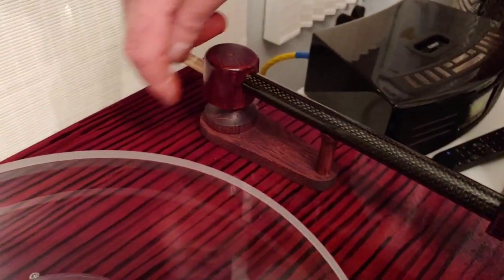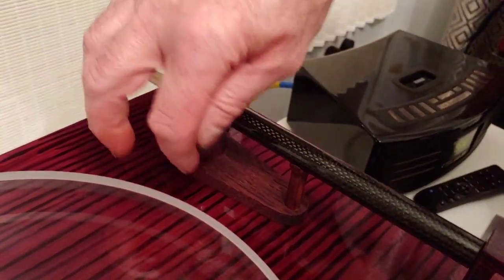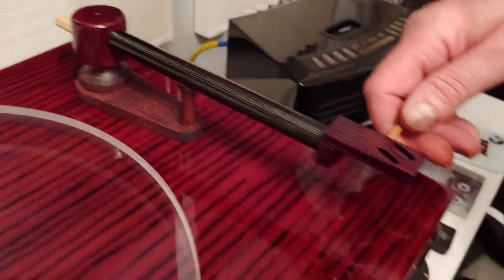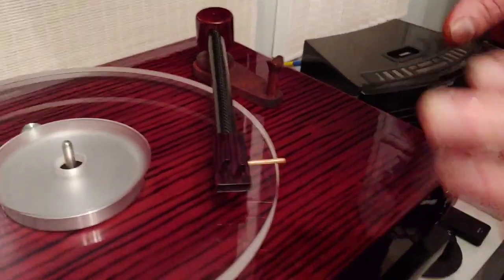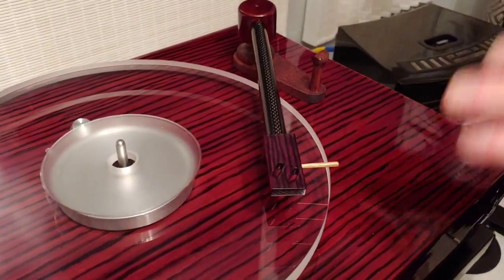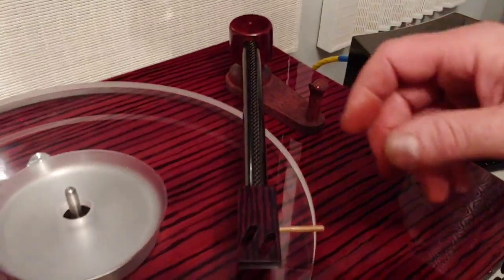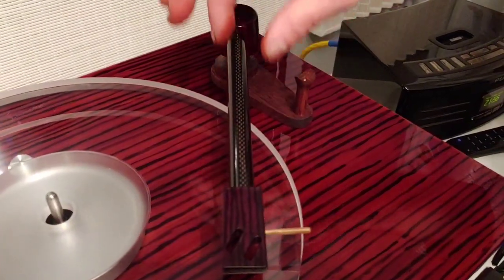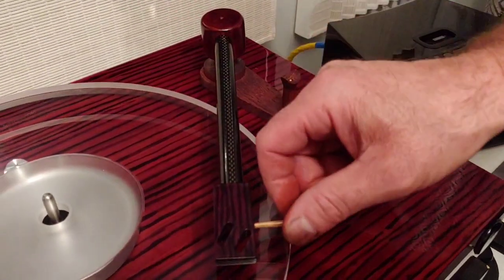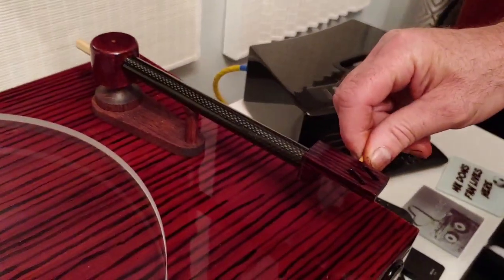There's no anti-skating on it at the moment. An anti-skating rod is going to come out the side, and another one out the bottom with the anti-skating weight on the side, and it will settle down. As I said, this is a prototype arm - just the start of me building tonearms. We'll probably go through several guises. The next version will probably have a thinner carbon fiber arm tube, and the head shell may change, but we're going to try this one out first.